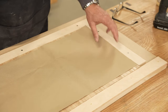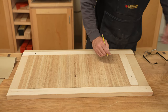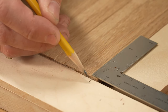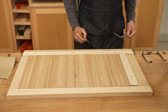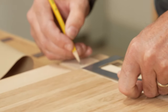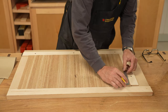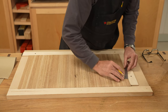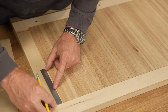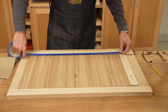Because I'm going to add glue to this panel, I don't want glue in certain areas. So I'm going to lay out a couple marks — about a quarter inch from the edge on that slat and about a quarter inch over that slat on this edge, and about a half inch up from either edge on the top and bottom. This is just for layout for my tape. So now I'm going to lay on some blue painter's tape and just match up to those lines.